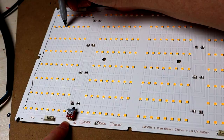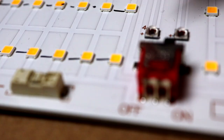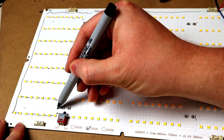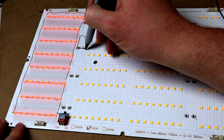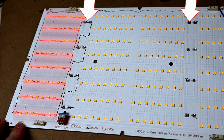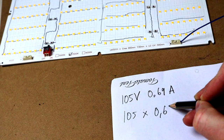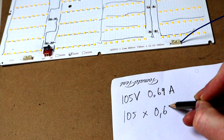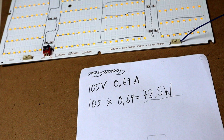The light has a switch to turn the reds and far red on and off — you would probably just leave the reds on all the time. The electrical current goes through all the chips in series, one after the other, then through the high power chips. Before, the same current went through eight strings of LEDs; now it goes through two strings, so about four times the current goes through these high power chips. This panel runs at 105 volts DC, 0.69 amps — multiply those and we get 72.5 watts. The panel could run at up to 120 watts, but for tomato tent we don't need more than 72.